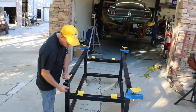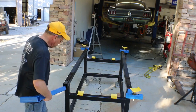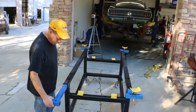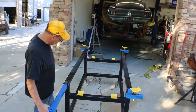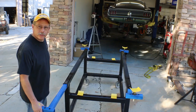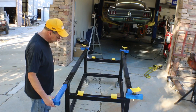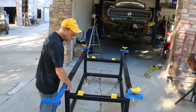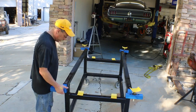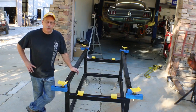And I'm showing you underneath there, I welded on some of those square nuts into the bottom. You saw that when I had it flipped over and drilling all the holes. And that's so I can run a 3/4 inch bolt up in there, and then you can pull that blue rail out, maybe 20 inches of the 24 its length is, and give you a lot of adjustability and the ability to tighten it up and push it up towards the top of the tube there, locking it all in. That was my thinking for reason to add those.